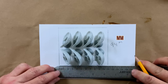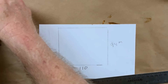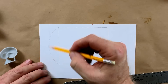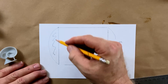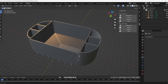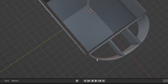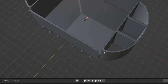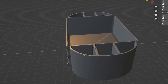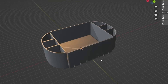I got them laid out the way I want them to sit in the box. With the parts set up, I can figure out the dimensions of the mold case. I also want to use these mold parts as a mold cradle when I do the actual resin pouring. So I'm going to make rounded ends on the sides perpendicular to the pull of rubber bands. I put those little feet on the long sides just to stick them to the build plate better and also support the walls as they got taller, since the walls don't have much surface to attach to the build plate. Those little feet actually worked out really well.